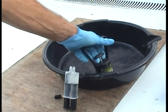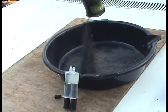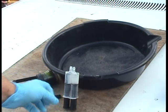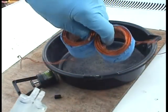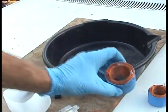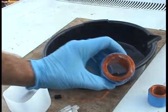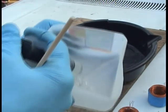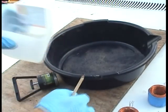Okay, now you mix black sand with epoxy and you're going to make cores for this. Here's some of the black sand — get it on eBay, look for people who have a gold mine and have a lot of this sort of stuff left over. I'm going to put about this much epoxy in there to fill two coils. With my finger, rim some epoxy all the way around inside first so that it's going to stick really well to the inside of the coil. Then fill up some plastic container with epoxy, stir it up, and add the black sand and mix it until you get it how you want it.